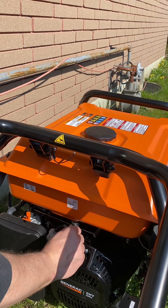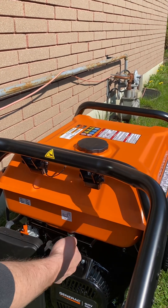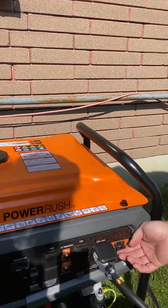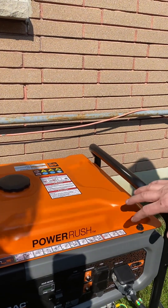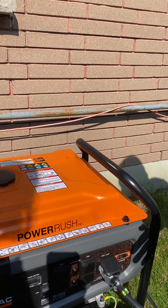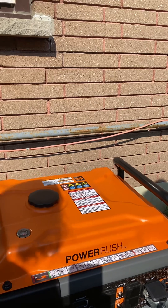When you come to use it, turn the fuel valve on first — that's the first thing you want to do, because if you don't, no gas gets to the motor and the motor won't start. Once the thing is running and the cords are already plugged in, you come here and flick the breaker on — that puts electricity into the cord and into your unit. You never want to do that while manipulating the cords; there's a small chance of getting a little flash and you don't want to deal with that.